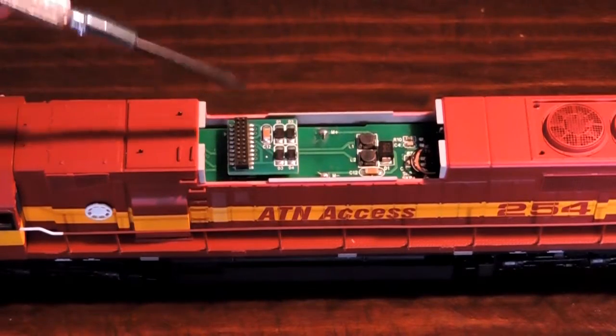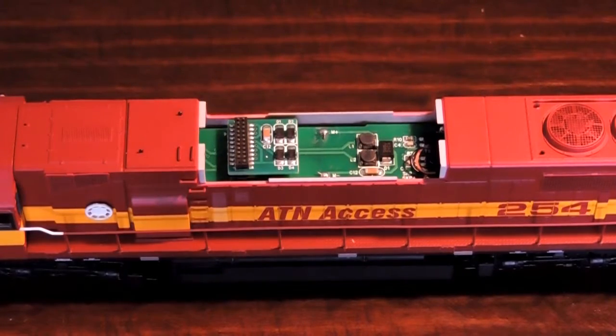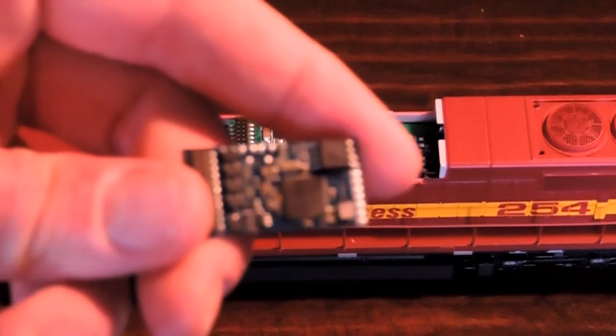So what I'm going to be doing — you see the chip right up here? That's actually for DC. We're going to be taking that out and replacing it with one of these little beauties, which is a proper DCC decoder. In case you were wondering how to find out which way to put it in properly, make sure that this side is facing up, just as pictured on the Southern Rail Models website, or if you've got the booklet, look in there for more information. This is an ESU LokSound decoder, a 21-pin.